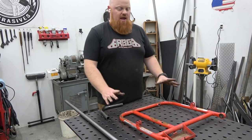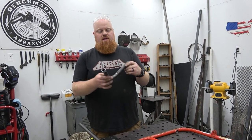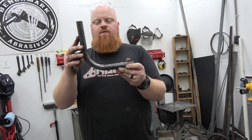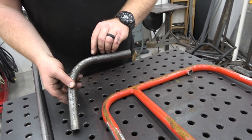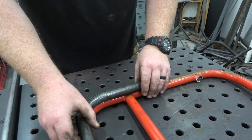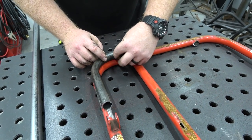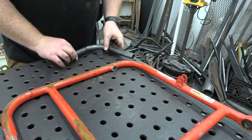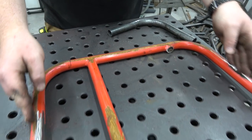Yeah, so how to replicate this is, first you need to bend a 90 in whatever bender you have and make sure it's a true 90. This is only about a half a degree to 1 degree off, so this is about as true as you're going to get. Then this is the line on my die to where the bend starts, so we're going to lay that on there and eyeball it as much as possible, and we're going to trace that line onto here. Then we're going to flip this, do the same thing, and that's going to tell us the distance between each bend to create this U again.